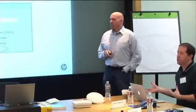So I would say, as feedback, I would love to see some adjustment in the band steering so that we don't negatively impact voice applications or clients. Let me ask a question, being the ignorant non-wireless guy in the room. So the band steering is going to occur when the client initially associates to the AP, right? And when you roam. So it's when you're roaming that you're concerned about it. Yes, because that 200 millisecond delay is essentially, if there's only one AP it's trying to go to, it either has to scan more channels to find the 5 gigahertz one, so that's time for the client to scan through all the channels to find the 5 gigahertz radio, or if there's only one AP in the area, then there's a 200 millisecond delay, and that can impact.